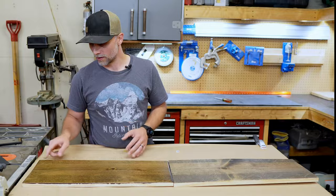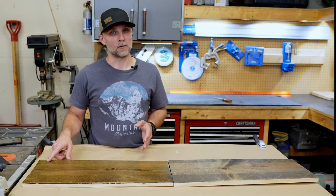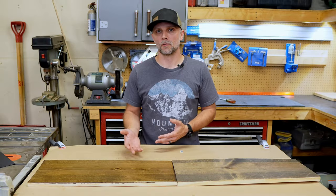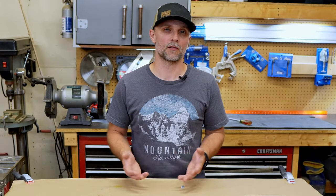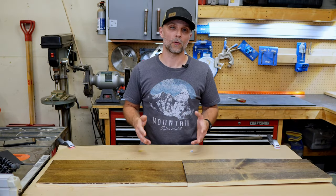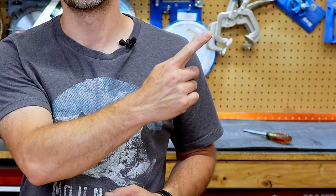Overall 99% of this board is dust free. When I was sanding that poly coat trying to get rid of dust in the corner, I mentioned I probably broke through that coat of poly — and this is what it looks like afterwards. The unprepped board has more of a flat dull finish, versus the prepped board which has more of a satin sheen — more like a furniture finish. I'm curious to know which finish you all prefer: more of the rustic look or more of the finished furniture look? Leave it in the comments below. As you can see, it's not hard to get great results with staining if you're willing to put in the extra steps of prep work.